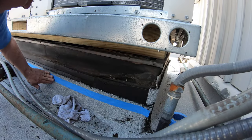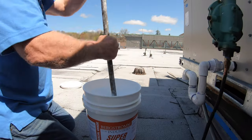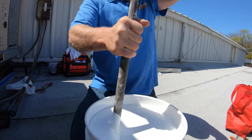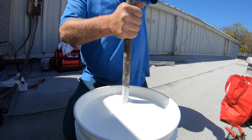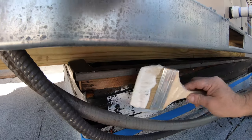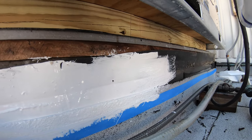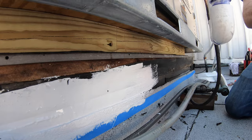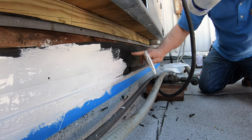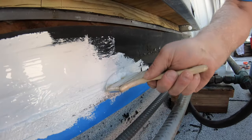I got my tape there. For a small job like this you don't need a big container — you need half a gallon. The paint is much thicker, the viscosity is very thick, but you want to get all the contents mixed well. I'm going to paint that carefully so I don't make a mess. I'm making a transition from a torch down roof to an EPDM material, because that's what's underneath here — this black here is EPDM, and this is torch down at the bottom.